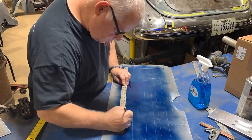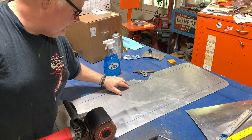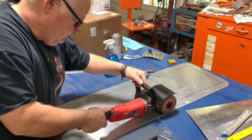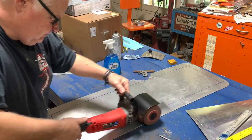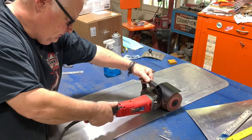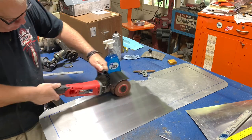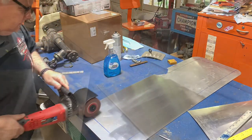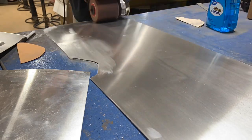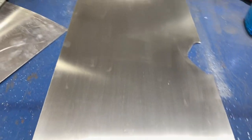We're almost there and it is time to start punching some louvers, but first we need to do a little bit of cleaning. Because it's really going to be hard to do this after the louvers are punched, there's a lot of scuffs and stuff on this side. We'll go ahead and knock off the front side and give it a brushed aluminum look. If you've never had to sand around louvers or scuff around louvers, louvers will eat your skin and knuckles a lot. It's best to do as much of this cleanup work as you can before you start punching. You can always go back and touch up any scratches - and there will be some scratches in this aluminum later - but let's get 95% of it done now. I got the old contour machine out, hit it with the red Scotch-Brite just to knock down some of the spots, make it a lot easier after it's louvered.